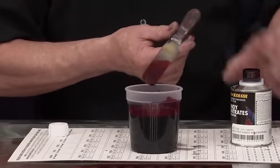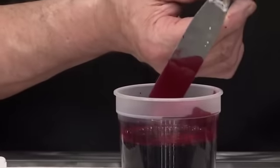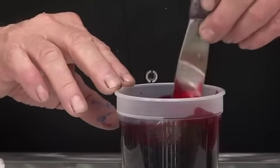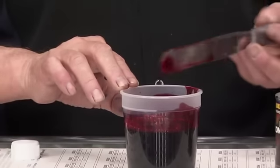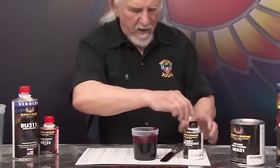I might add just a touch more, but it's looking really good. The most important thing you've got to remember is to put enough coats on. So many guys will stop painting and say they quit at three coats. Why did you quit at three coats? Because I liked the color. Well, then it fades out. Do you like the color now? The point is: put enough coats on. We do recommend at least five to six coats.